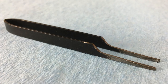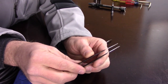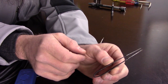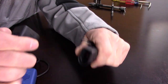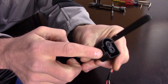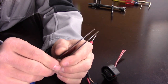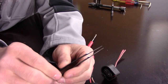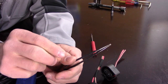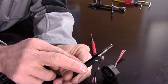One of the other really common tools we end up making is wire pin tools. One of the other guys in the shop made this one — he took a piece of the metal support from a wiper blade, bent it in half, and ground it down so that it would fit inside of a connector to release the tabs on the wire so you can pull the wire right out. Special tools like this from Volkswagen are about $50 a piece, and this was free other than about 10 minutes of work. In some cases it actually works quite a bit better than the factory tool.